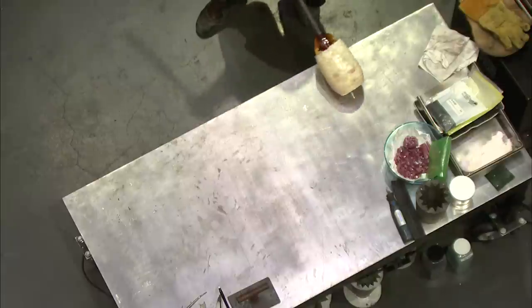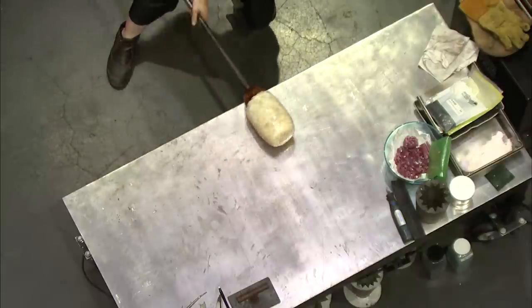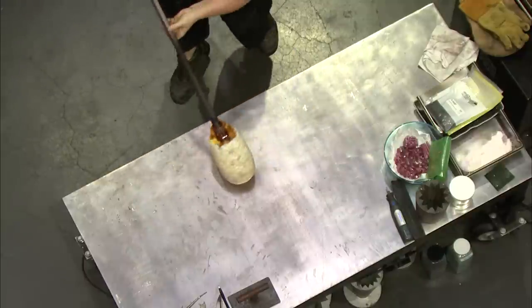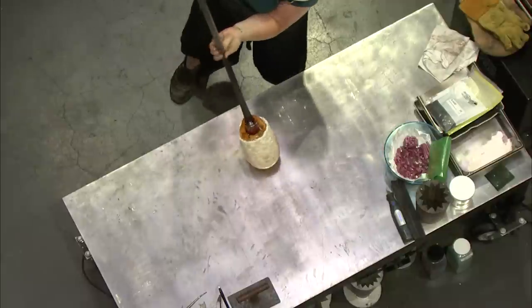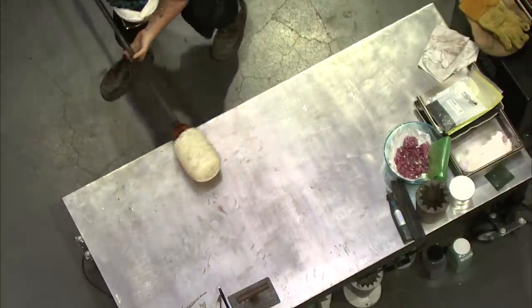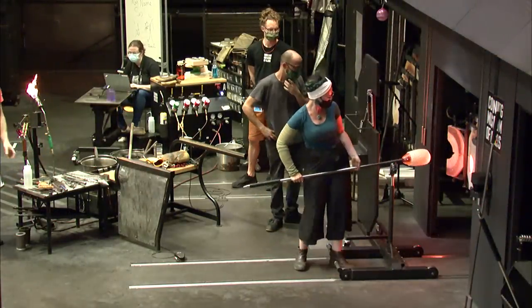We can also feel the glass softening as we're in those ovens. So the longer you stay in there, the more gravity's pull kind of feels on it. If you were to stop turning, the glass would slump. Now, the hotter it is, the faster it slumps. But you can really feel in the torque that you have to apply with your hands and your fingers when the glass is getting hotter and hotter. Furthermore, you can feel when it's getting colder, too, or stiffer. It becomes easier to turn those blowpipes. So we really do rely on all that dexterity.